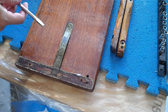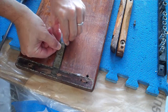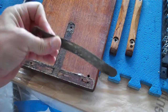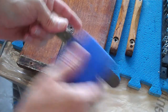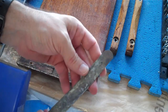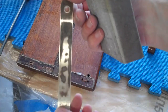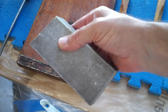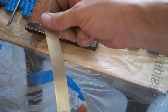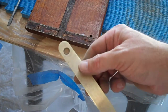The spring clip is held on by a number three flat head. I'm going to test sand the inside of this spring clip and see how it goes, and if I like how the varnish comes off I'll do the outside as well. This spring is brass and it's cleaned up pretty nicely — this is a good use of a foam block. That brass spring clip sanded up pretty nicely. I didn't put quite as much effort into the underside, which will be hidden, as it's on the front.